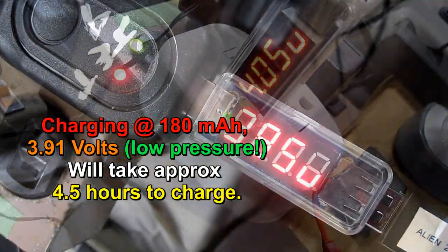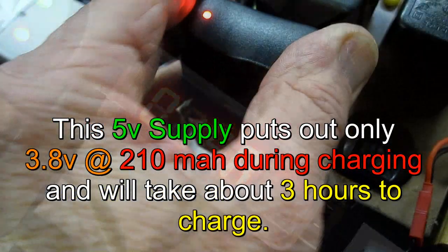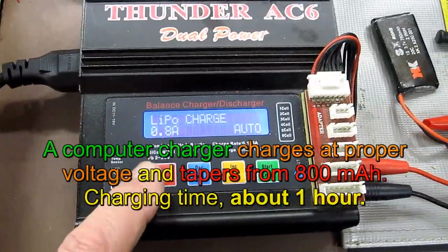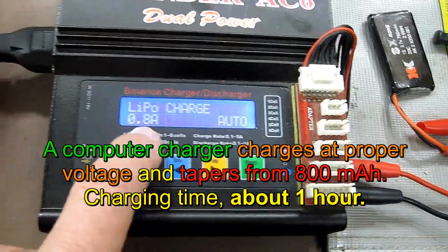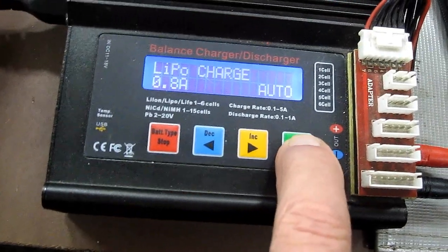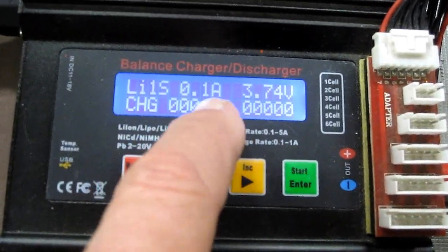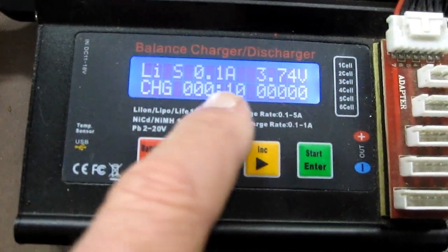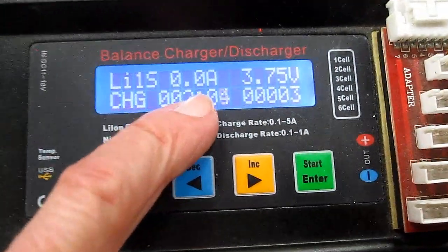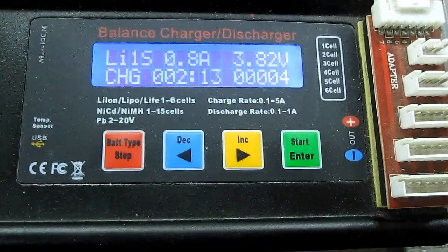That one doesn't do much better — when it's charging it's only at 3.91 volts, so that's no good. I've set for 800 milliamps because the battery is 780mAh, so I can go ahead and do that and set it on automatic. This will put in plenty, so we'll go ahead and start. It's checking the battery — it says it's at 3.74 volts right now — and it's charging at 100 milliamps initially. When it decides 100 milliamps isn't enough, it's going to kick up to the full amount. Now it's gone to zero and then cranked back up — it's charging at 0.8 amps, that's 800 milliamps.